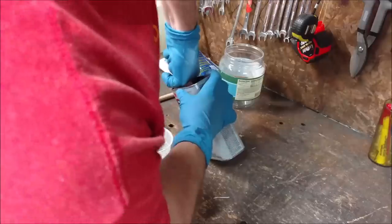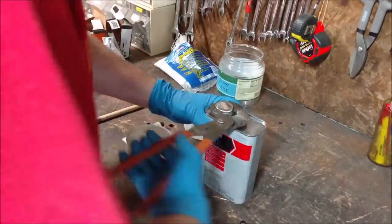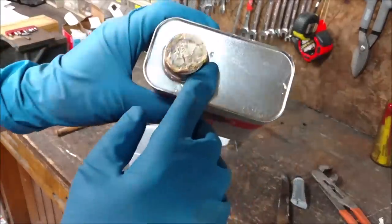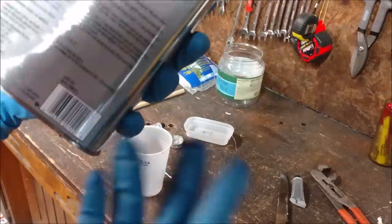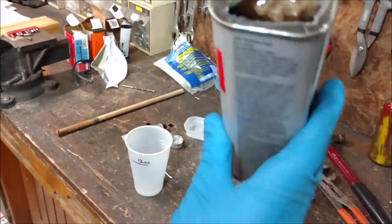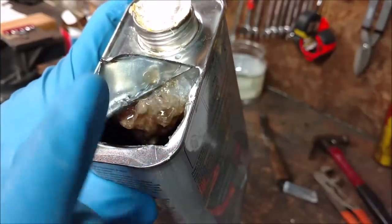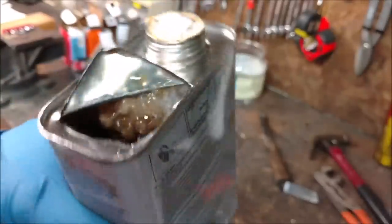It is actually raining today outside, so I will not be doing this outside. Hopefully this stuff is still good. The lid has pretty much stuck itself on there. So it seems like this one is actually solidified into fiberglass or plastic. This might be a little old — you know, 2010. There is still some liquid in there, so if we can get it out, we're going to see if we can still use it. You can see that nice big wad of plastic in there. If you leave this stuff too long, it does start to crystallize, it does start to solidify. So unfortunately you can't really hoard this fiberglass resin like you can the cloth. I'm going to go ahead and see if this still works — like I said, it is still liquid in the bottom.